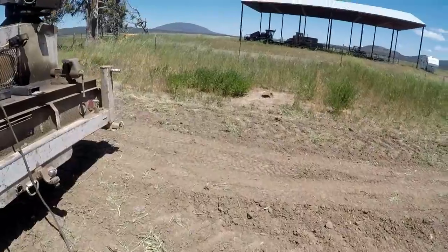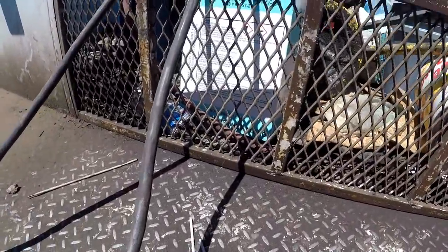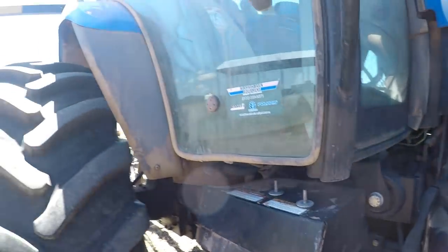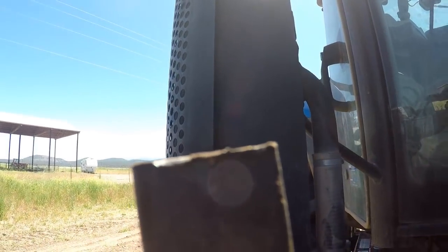I brought some angle iron with me. It is kind of a poor design, the way they got that 90 there and no metal up there high supporting that. I guess we'll just gusset it. Just take this angle iron, cut a chunk off there, and go from here to maybe here. See if it'll hold together. That's what the owner wants. I told him that's about all you're really going to be able to do with that.